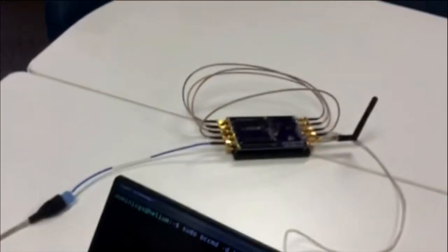There isn't anything transmitting. But Dominic over here is about to start transmitting with his Bluetooth dongle, which you can see plugged into the USB cable, that little blue blob plugged into the USB extender. That's actually a tiny USB to Bluetooth adapter, and that's plugged into his Opera Cake. Now, his Opera Cake has four different wires in it. I think you're only using two of them. But they're four different lengths of cable, and he has the ability, from software, to control which cable is switched into the path between the Bluetooth dongle and the external antenna. So initially, you can press play.